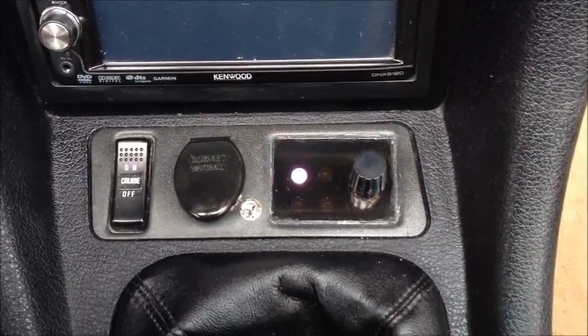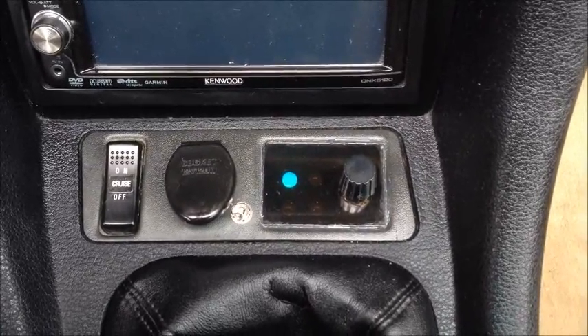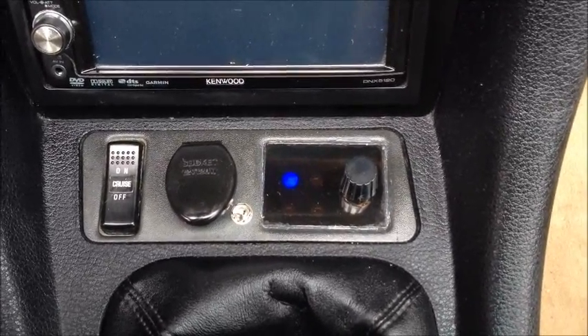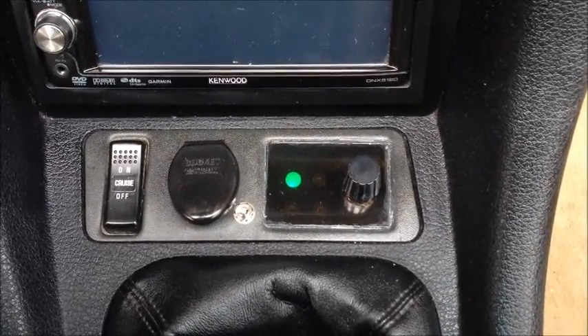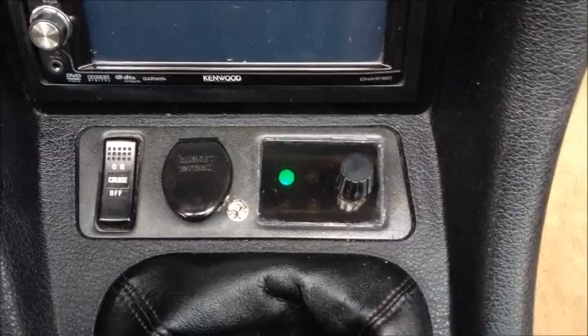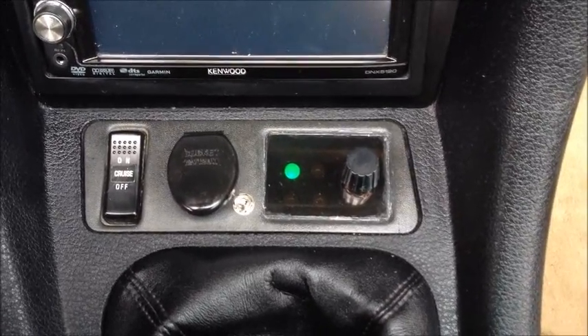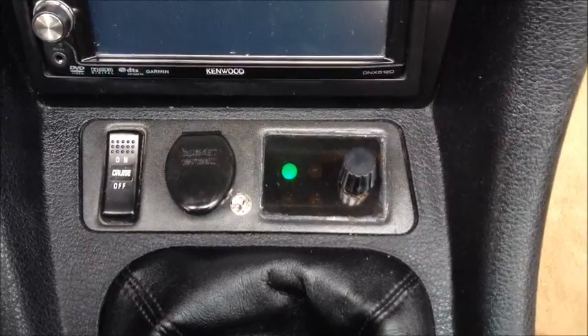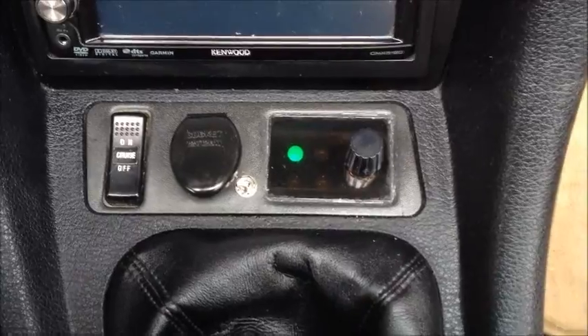As you can see, it's now about to test the front left strut. It's going to walk each strut through hard, medium, and soft. If the strut passes, it's going to put up a green light at the end of the test. There's a pause here because the controller would also be sequencing the console lights — the sport and tour lights — showing the diagnostic results as well.